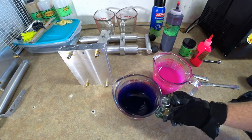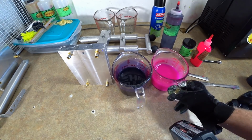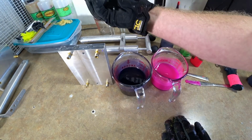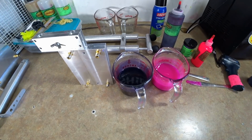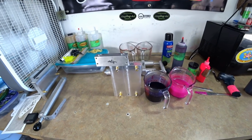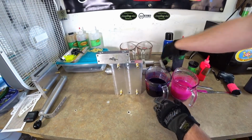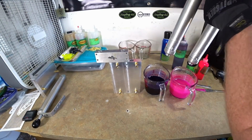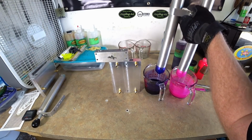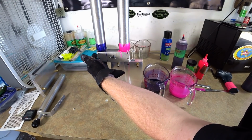It's about 310 degrees, 307 and 301. So we're actually going to shoot with those low temperatures right there, and that's one of the things that I like about the dead-on plastic, is that I can shoot with these low temperatures, and it still comes out fine. So we're just gonna back the camera up a little bit just to give you a better angle of this. So I want the top side to be the darker side and the bottom side to be the lighter side. That's generally how I make laminates. For whatever reason, I'm drawn to that sort of color pattern.